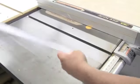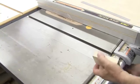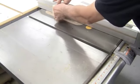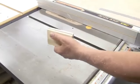So now we're going to fabricate the panels, and in order to do that, we got to make a slot on one side to accept the 1/4 inch plywood. So I set the saw to be about almost in the middle, run it through, turn it end for end, and run it through again, and that makes a slot. And I check it against the 1/4 inch.